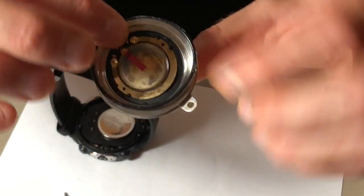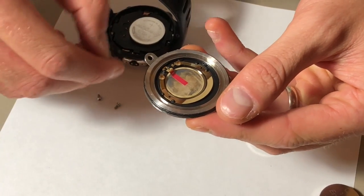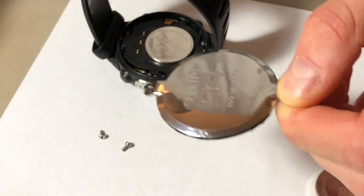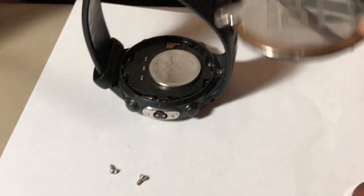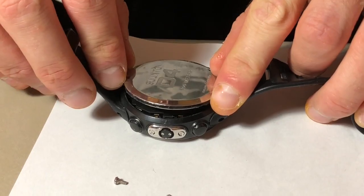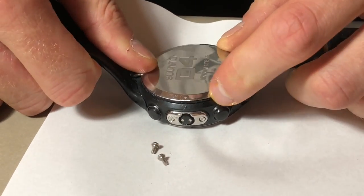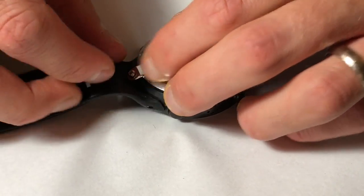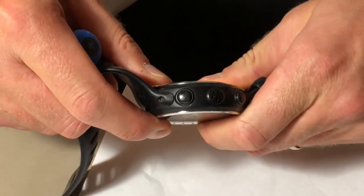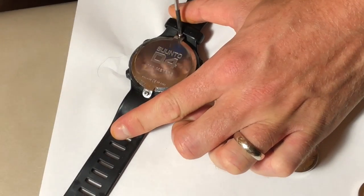To put the o-ring back on it's pretty easy — you just stretch it into place. That o-ring's back on. Remember before we were talking about these little dots — here's our one dot and there's our black dot, so we know this is how we want to get it back on. Just drop it in there, line up the dots. It feels like it's going into place. You want to keep even pressure on both sides, and that o-ring is now squeezing in there nice and tight because it's a fresh o-ring.